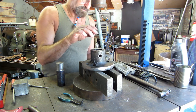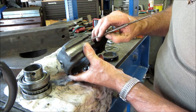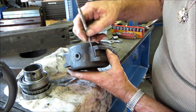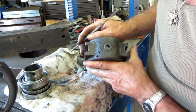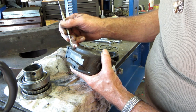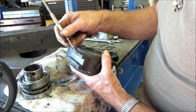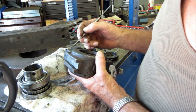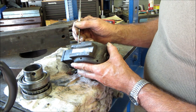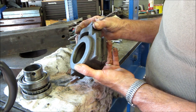We're going to measure and start making the new shaft. When that shaft snapped it must have caused an enormous amount of torque, because there's a crack right there and this ear is cracked all the way down - it's going to break off - and this crack goes all the way down and around. Exactly the same on both sides - it was even thrust. I'm getting ready to finish breaking those off, and then I'll probably fill that in with braze and reshape that groove - that would probably be the strongest way. You can't properly prep to get 100% penetration on a chunk breaking away like this; my experience has been better to build new.